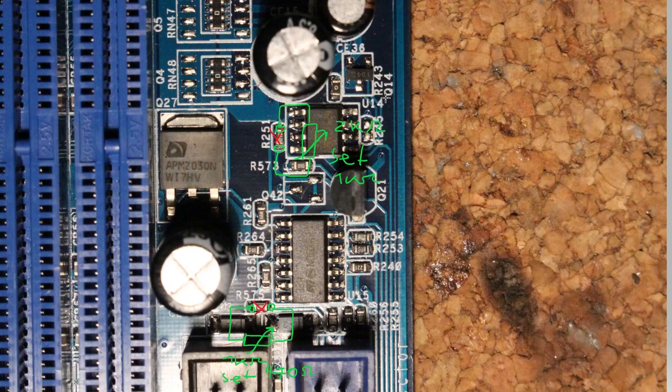For the measuring points I would suggest just watching the video where I show the actual board. You can see that my red wire is connected to memory and the yellow one to the north bridge. Since I can't easily show measuring points on the front of the board in this image, grab them on the back from the capacitors.